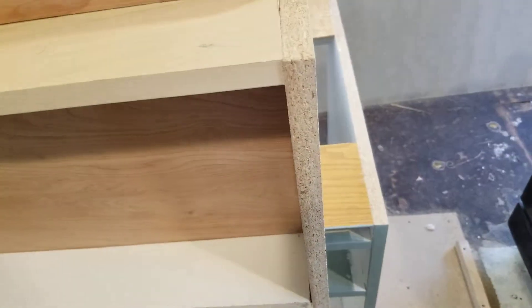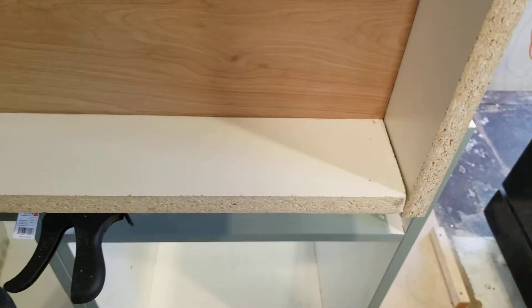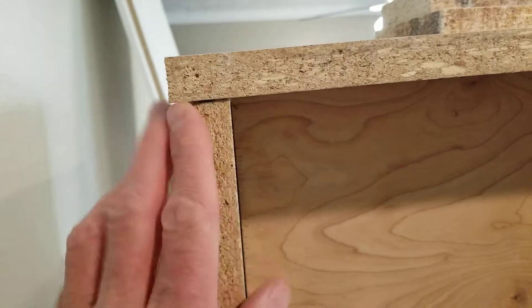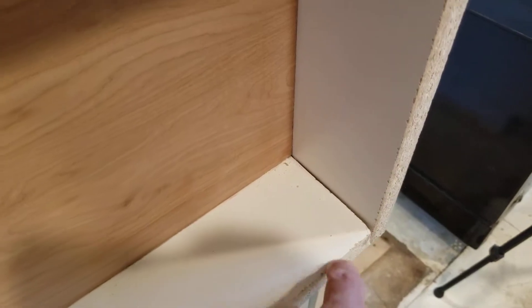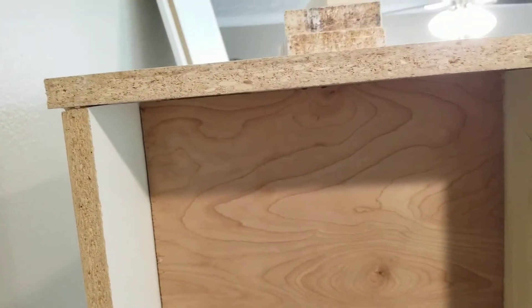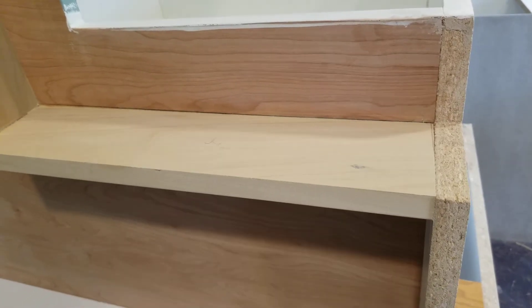What I've been thinking of doing is I'm going to take all of these exposed edges down on the floor where it's going to be on the floor, and I'm going to paint them and put several coats of paint on these, and then I'm going to seal these edges with caulk — all those exposed edges to keep the water out. I think I'll end up having a better chance of not having to replace a cabinet if we do have a flood. I'm going to do the same thing under the kitchen sink — caulk around all the bottom edges and paint, and hopefully we will not have the problems that this shows you can have.